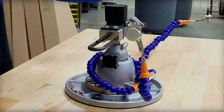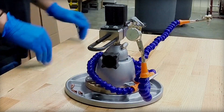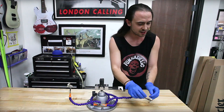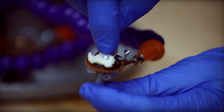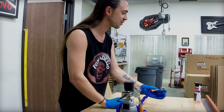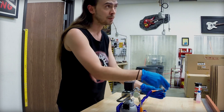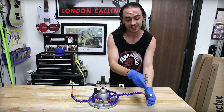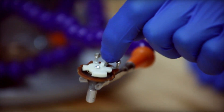But first let me go over how a pot works and show you the insides, and we'll break down exactly what we're dealing with. A potentiometer is a resistance track connected to the two outside pins. The middle pin is electrically connected to a wiper which rotates along the span of the resistance track. At one end it's fully closed — the current is facing maximum resistance. As you rotate along the span, the resistance facing the current decreases until it's all the way connected electrically with the middle pin.